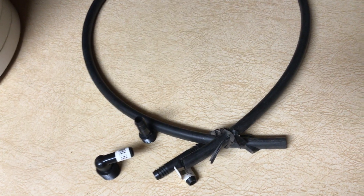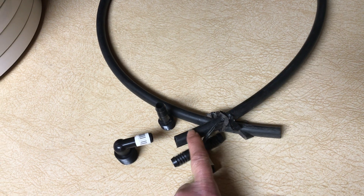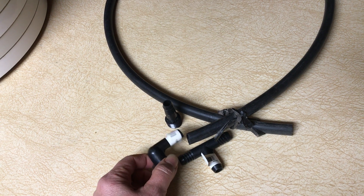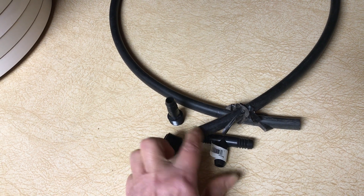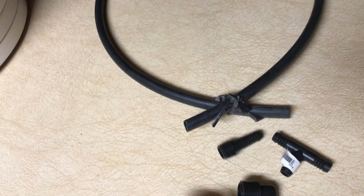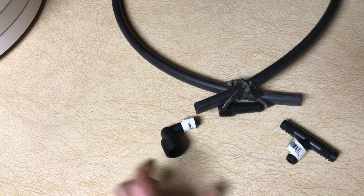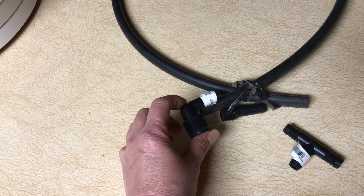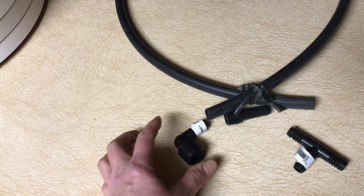If you have this funny pipe and you have a fixture that's too loose — like I had a problem three or four different times where I'd put this in, bury the sprinkler, and then have flooding — what happens is this is not very secure. The different companies' parts don't fit together as well as they should. So I always test it before I bury it: I turn the sprinkler on while it's unburied and make sure the connection isn't going to push off.